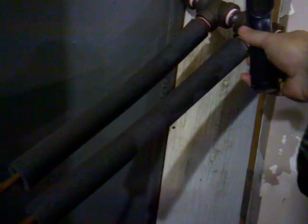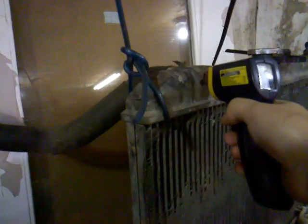I can grab the lines right here and they're still actually colder than room temperature because we've got a flow going here, and these ones up here are a little too hot for me to touch — I'd burn myself. Let me get a reading for you here with the heat gun. So yeah, just under 160°F. Off the top of the rad it transfers heat a little better because it's copper, so we've got 166°F. At the bottom of the rad we've got 69°F.